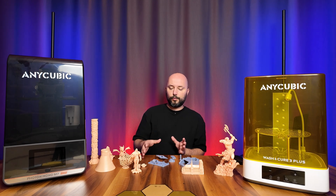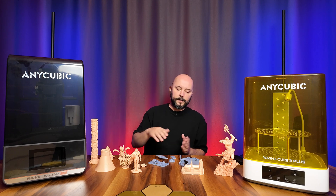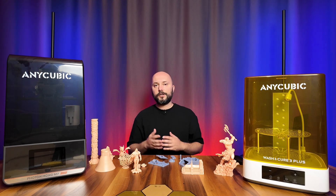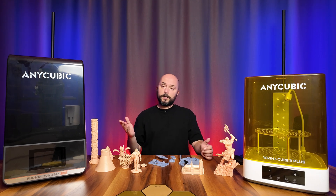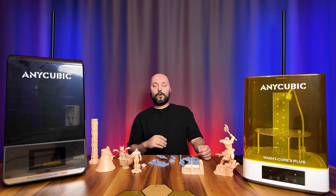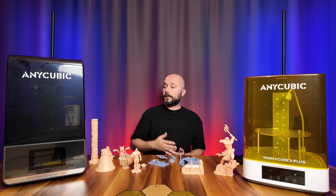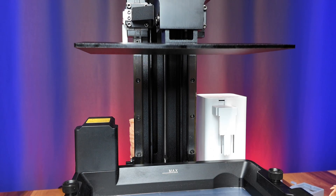My advice for anyone looking to print with resin for the first time: if you buy the M7 Pro, make sure to use the manufacturer's own resin for your first prints. If you want to try a different brand or type of resin later, research its parameters and ask the manufacturers — know your exposure times. Otherwise, you'll encounter problems with incorrect support settings and exposure times. New users often assume these problems are due to the machine itself, but they're related to settings or table leveling.